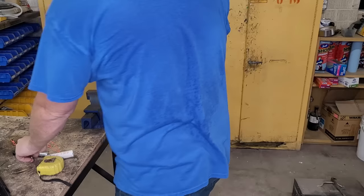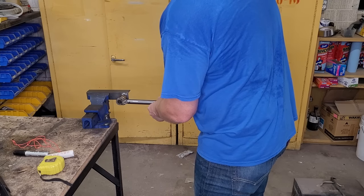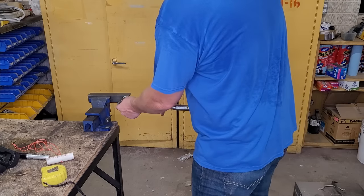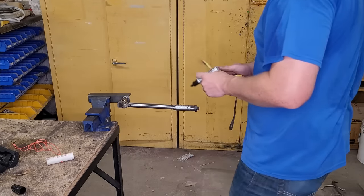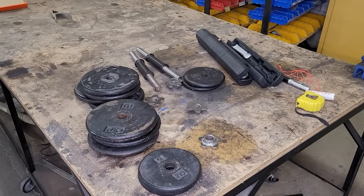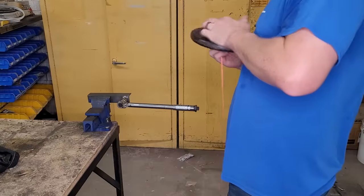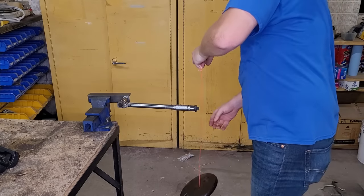Let's start with the 3/8" drive using a little adapter to make it half-inch. We're going to plug that right in and use the ratchet to make it approximately horizontal. To get foot-pounds of torque, one foot-pound means one foot from the pivot point pushing down at one pound. We measured out one foot, which falls right here on the handle — that's where we'll apply pressure. We have weight plates that I've weighed and they're all very accurate. We'll feed a 10-pound plate onto the string and set it at our one-foot mark.